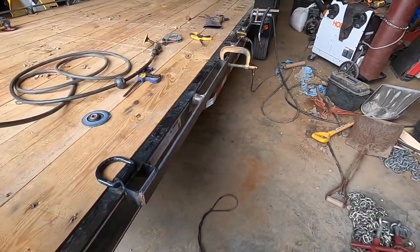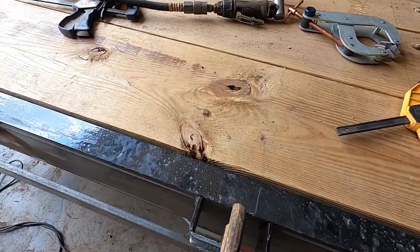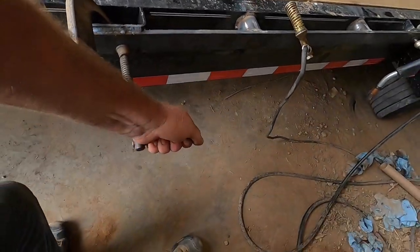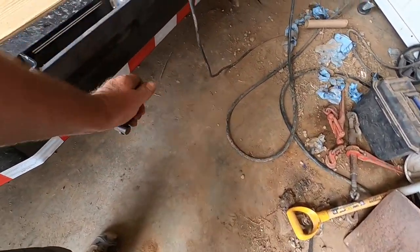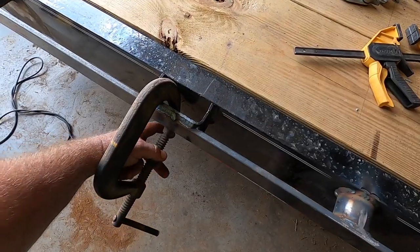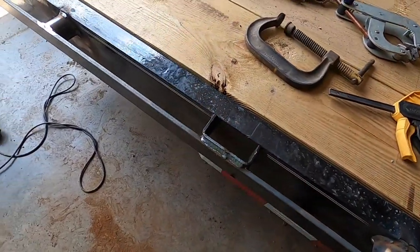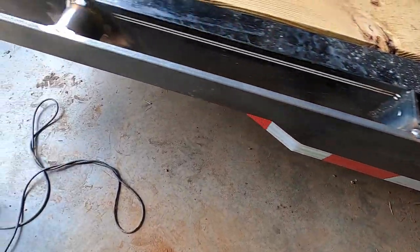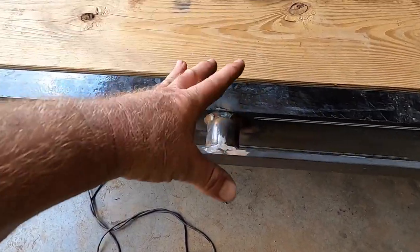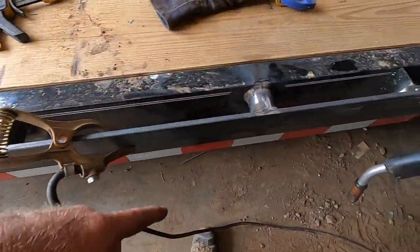All right, I have a few more welds to do. I went ahead and figured I'd just closure-weld the stake pockets. Let me get this clamp out of here — one hand, it's hard. I fully welded the stake pockets all the way around to the rub rail. I closure-welded — welded for structure — but I made sure there weren't any pinholes around the spools.